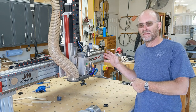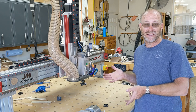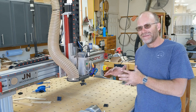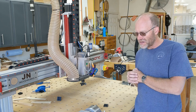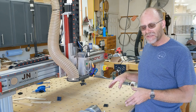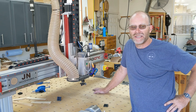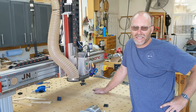The reason I want to do this is I get vibration in my whole table when I really push small fonts — like with the laser or v-carving — and I run 60 inches per minute on really small tight fonts where the X and Y axes might both be accelerating at the same time. The whole table kind of vibrates a lot and it can cause little ripples, especially in v-carving. You notice it on a shiny surface on the edge where there's a little ripple because of the vibration. I already had quite a bit of bracing and some extra pieces that don't normally come with the table, but I'm going to add more strapping and try to measure it quantitatively — instead of just feeling it and judging based on what it feels like, because sometimes that can trick you. I'm going to measure before and after and show you what that's like.